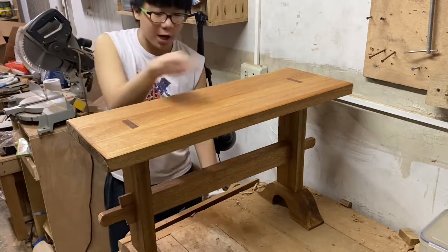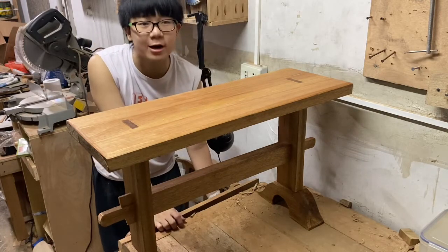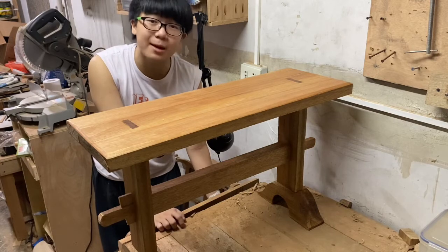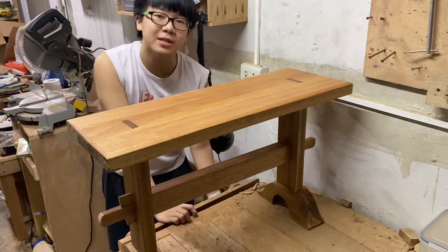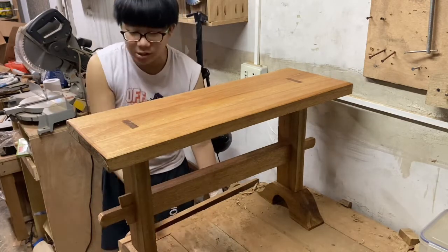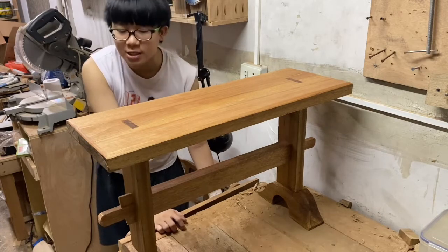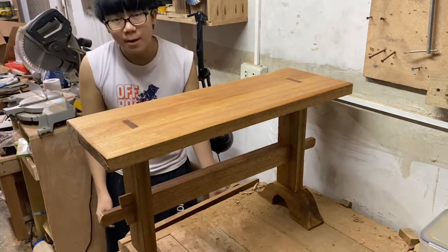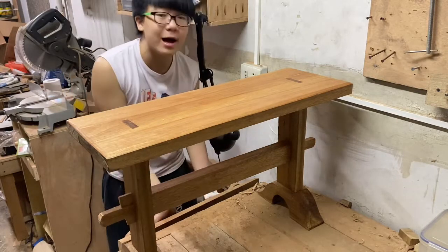The basic construction is just mortise and tenons — actually this is the most mortise and tenons I've cut in a project. I never made a table yet with mortise and tenons, so 6 is the most that I've made. Two of these are normal wedged mortise and tenons, and the ones at the side are called tusk mortise and tenons, where you cut a tenon with a part sticking out and pound wedges on either side to lock it in tight.